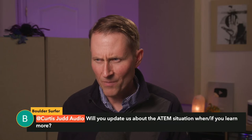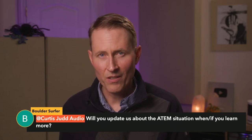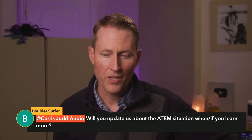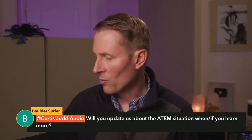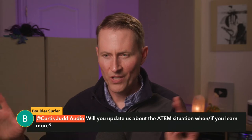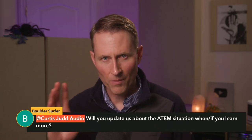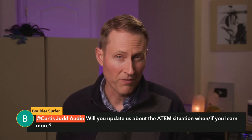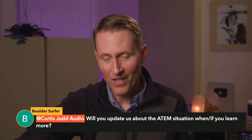Boulder Surfer, will you update us about the ATEM situation when and if you learn more? Yeah, so definitely, we'll do that. I want to do some more testing with these when I have the two, because I had the ATEM Mini Pro on hand as a backup in case the primary failed. And yet I'm also using, Danny uses the 1ME control panel to control it. So what happened was things got confused on the network. All three of them were connected to the network. And when I went into ATEM software control, I think it was getting mixed up about which ATEM it was using to do the streaming. So I couldn't get it to switch over to the ATEM Mini Pro in the period of time I had. So if I want to have the control panel controlling the ATEM Mini Extreme ISO, they both have to be on the network.